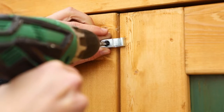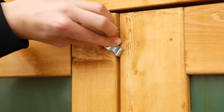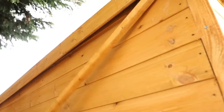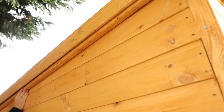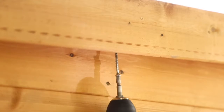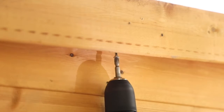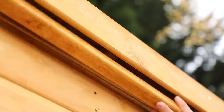A turn button also needs to be attached to the top and bottom of the slave door. Position the button over the door gap and secure in place using a screw. The rear and side roof gaps are filled using additional framing. Position the longer framing piece under the rear left fascia boards so that it butts up against the roof framing above. Secure this with screws at each end and the middle as shown. Repeat this for the front side roof gap using the shorter framing bar.